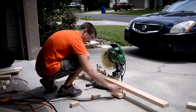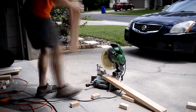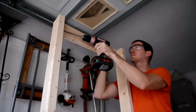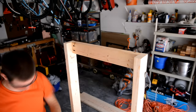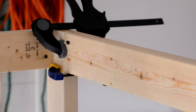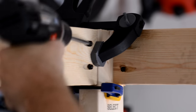It is time to make the bottom leg supports. I started by making the small ones, which are just counterparts to the ones we just installed. Make sure everything is flush since this part will be in contact with the floor. Once I was happy with it I made the pocket holes and screwed it in. Same deal with the other side. The final piece is the long foot piece — basically the same steps as the two smaller ones, just longer. I used some clamps to hold the piece in place. Clamps are so useful, they're like duct tape's first cousin.